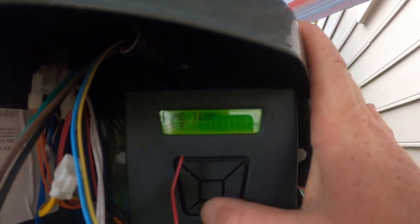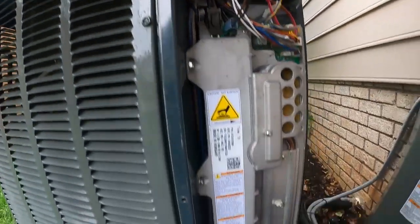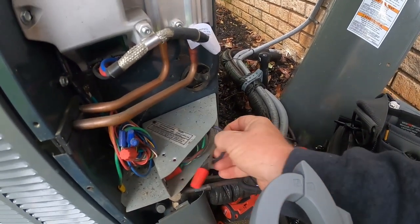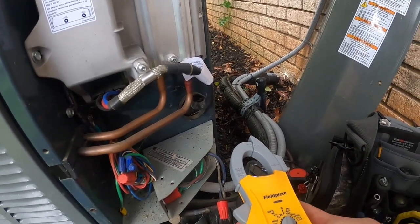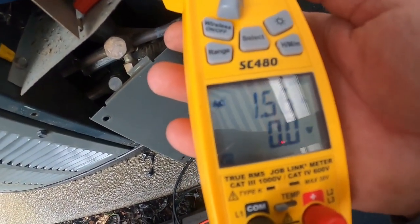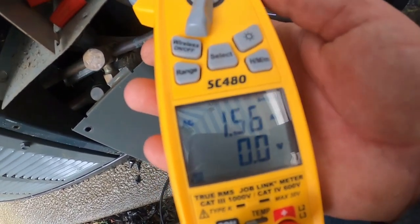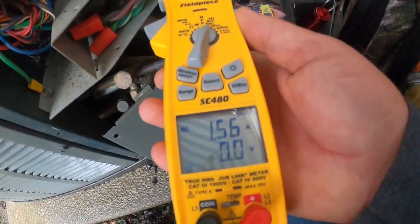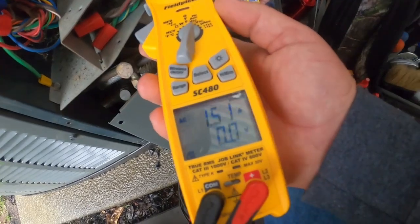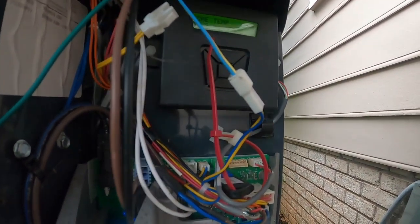I'm not sure this thing will come on without warming up that dome temperature sensor — I've had to pop the top and hold it in my hands for a few minutes before. I think the threshold is maybe 60 degrees. This does have a sump heater on it. If I check the amp draw on this thing, set the meter for amps — you see it's pulling about 1.5 amps. That lets you know it's in compressor heater or sump heater mode. There's no belly band or crankcase heater on these compressors — the unit uses the windings to heat up the compressor internally. So we may need to wait until it warms up enough to allow the compressor to come on.